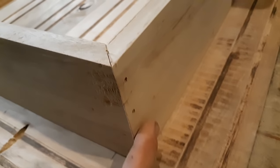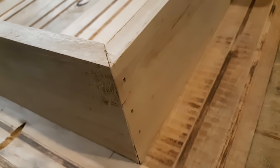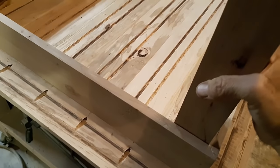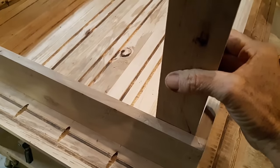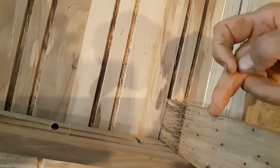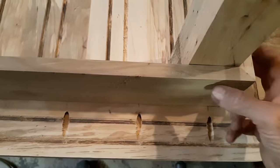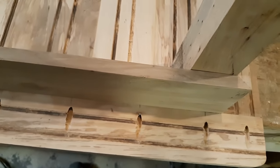Now we're going to come back and put some putty in these holes — we've got some that'll be the same color. The next thing is the legs. The legs will fit up in the corners just like that, and we're going to cut the post out in a corner down a certain distance and put a brace across — it's going to sit crossways so we can fasten the post in here as well as out here on the outside edges.